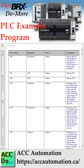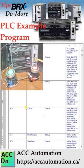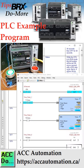Like most PLC manufacturers, the Do More PLC has system-assigned pulse bits. These bits will turn on and off at a 50% duty cycle. This means that a one-second system bit will be on for 500 milliseconds and off for 500 milliseconds. The Do More PLC includes a one-minute and one-second pulse bit, as well as a 100 and 50 millisecond pulse bit. These can be utilized in your program.